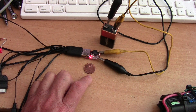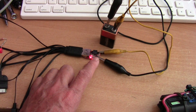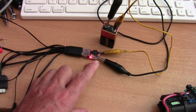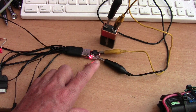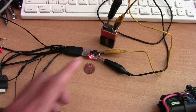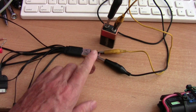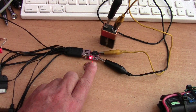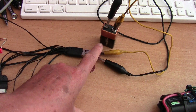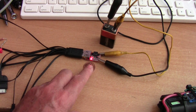This tiny converter can handle up to 3 amps. If you're using it at 3 amps, of course, you have to put some kind of heat sink on it. But if you're just charging at a 2-amp load, this is fine. If you're charging maybe an iPad, I think you can probably do it without any problem.